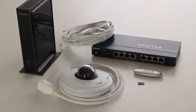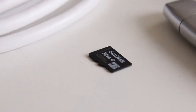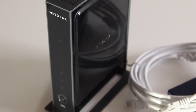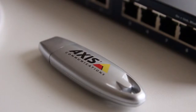To begin, let's view the equipment needed. We will use four AXIS M5014s, but you can connect up to 16 cameras to a system. One SD card per camera for easy video storage. An optional router to automatically assign IP addresses and to enable internet access. A power over ethernet or PoE switch to provide power to the cameras. Network cables and the AXIS Camera Companion client, which can be downloaded for free from the AXIS website.